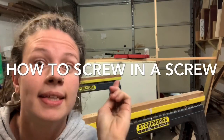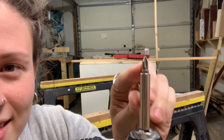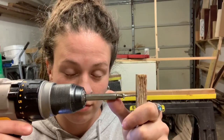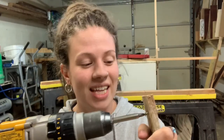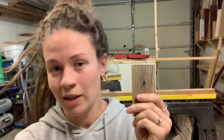When you're screwing with a drill, you have to make sure you're pushing down with enough force to keep the bit seated in the grooves of the screw. All you have to do is listen — a good sound means the bit is engaged; a bad sound means it's slipping. If you're not holding the bit and screw firmly together, the inside tips of the screw pattern will break off and the screw will be stuck — you can't drive it further in or back it out. You'll also bend over the ridges of your bit, ruining it so it can no longer work with a healthy screw.